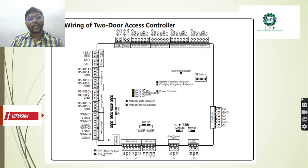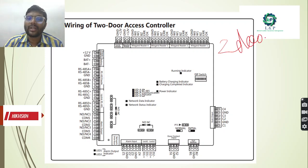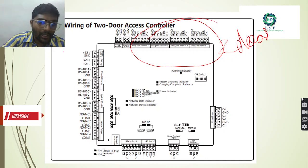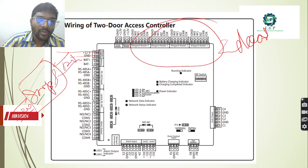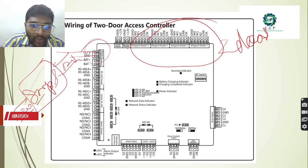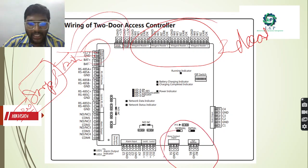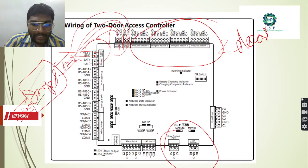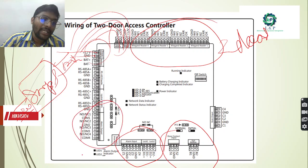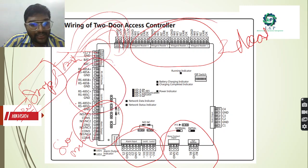Next, this is the wiring of a 2-door access controller. As you can see here, using this we can control two doors. We have four card readers here, and a 12-volt supply provision. Either from the SMPS - 230V input, 12V output - for this controller and card readers to operate, it needs 12-volt power supply. You can connect it here, and also for commanding the output for door contacts and providing power for the lock, we can connect the 12-volt supply here. These are going to be the alarm inputs and alarm outputs - it might be some sound alarms or buzzers. For the communication purpose, for the readers you can use RS-485 communications.